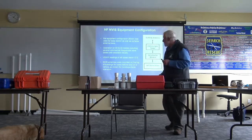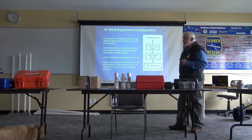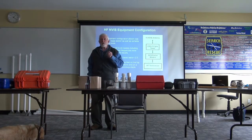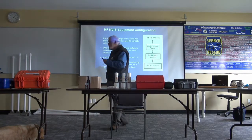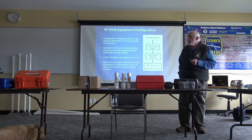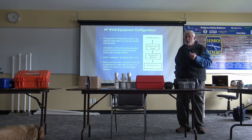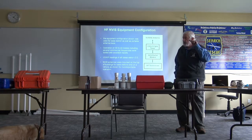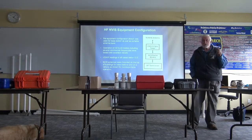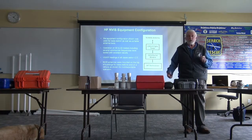In the setup you've done here, what is your wattage capacity for output? For the antenna? You could probably put 500 watts in without a problem. Your limitation is going to be the coax, not the antenna. I'm using number 10 wire. That's pretty hefty. And the reason we did that is we've never had any trouble with wind or anything like that. The result of using the heavier wire — and make sure it's stranded. Do not build an antenna out of single-conductor wire because it will vibrate and break in the wind. But stranded, you won't have any trouble with it.